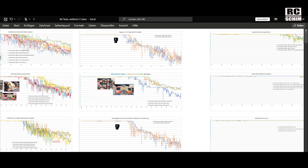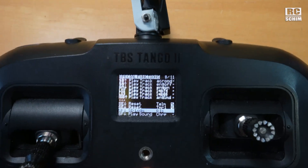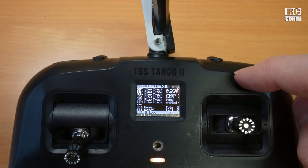If this was too fast for you and you want to take a closer look, go ahead and download this Excel spreadsheet or view it online. So my current test setup — and this should really be the best way to test antennas, at least DJI antennas — is using my radio to receive the telemetry logs from Betaflight. On my switch SF, which is my arming switch, I also have the function SDLogs at 0.1 seconds interval, and that gives you a CSV file on the radio which you can download.